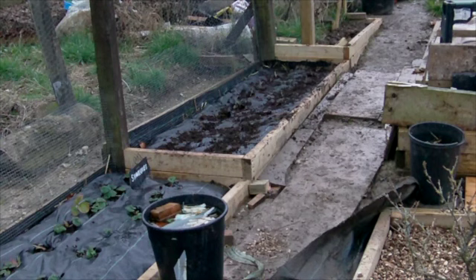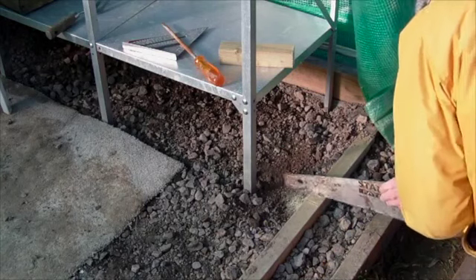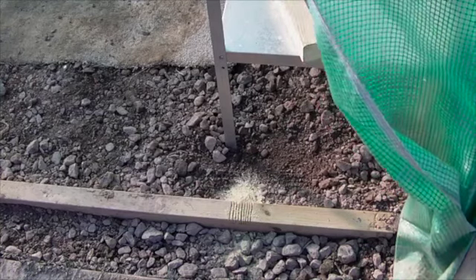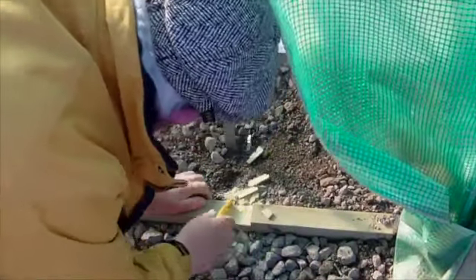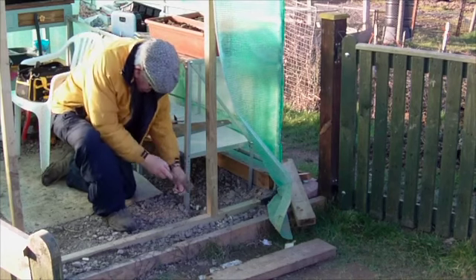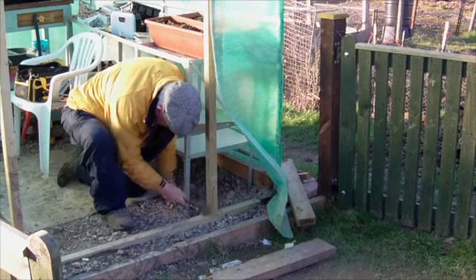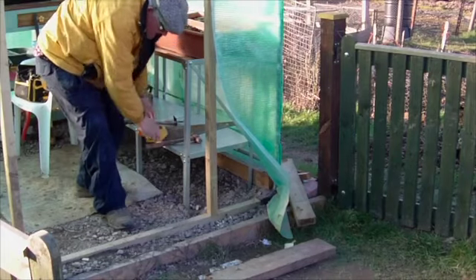Next day back on the site, still having trouble with this sill. I placed a short end of 2x2 where the door starts and cut a series of slots in the top. Then with what we used to call at work an electrician's chisel — which is a screwdriver — I knocked away the bits of wood, cleaned them up with a knife, and tapped it in to see if it fits. That's not a bad fit. The main posts for the door frame are put into position into this slot at the right height, which is five foot six. The door opening is 40 inches, and they were fixed at the bottom into that housing.